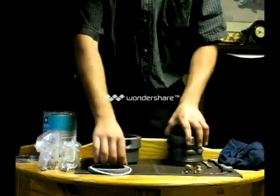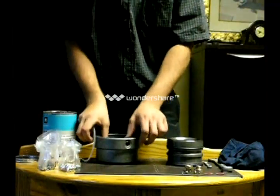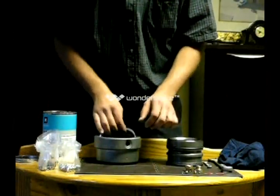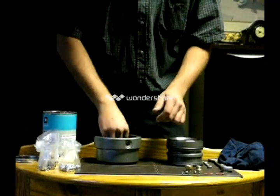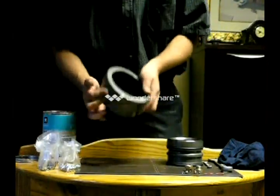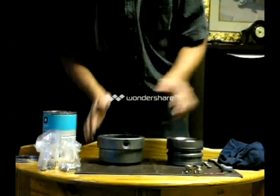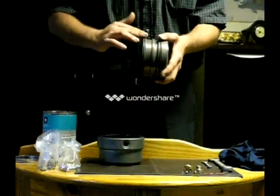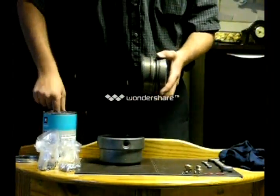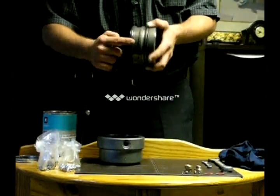From this point on, your bumper ring and your back-up ring will slot into your outer housing to the bottom — nicely firm to the bottom. From here on, we will apply some grease to the outer side of the o-rings for them to be able to move, also for some extra lubrication.